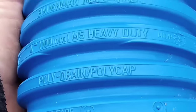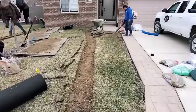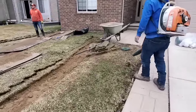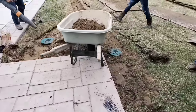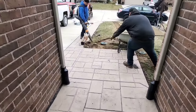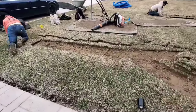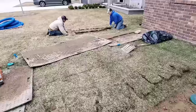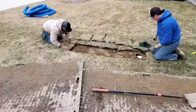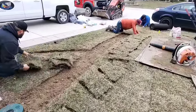This is a really small catch basin — it doesn't hold a lot of water. We're getting away from those big basins that hold a lot of water; they just get you into trouble. This is the extra heavy duty High Octane Armor Pipe — we're able to do things we've never been able to do before. After you pack all the dirt on the pipe and make sure there's no air pockets, take the heel of your boot — the pipe is so heavy duty it doesn't matter. Make sure you blow all the dirt left in the grass right on top of the drain system and put the sod back on top.